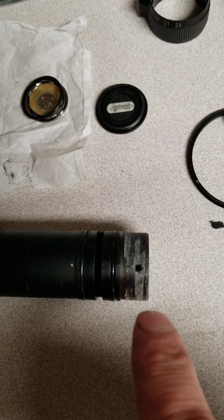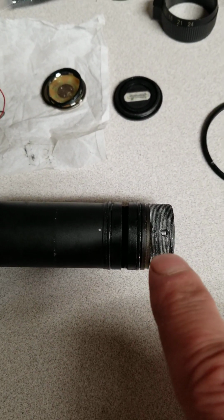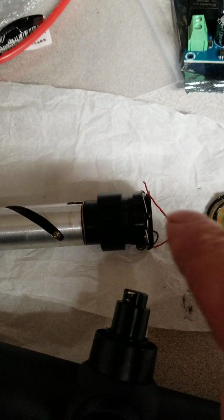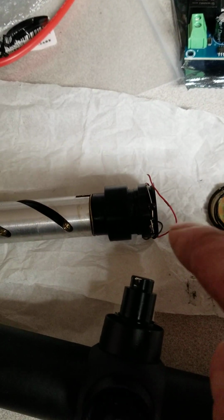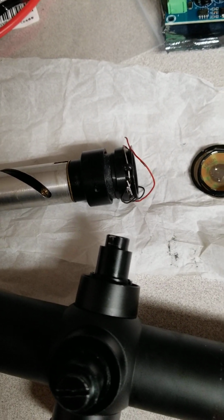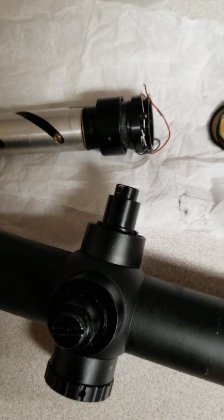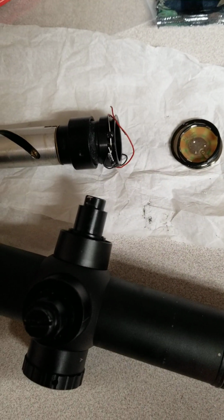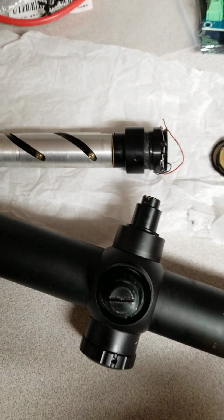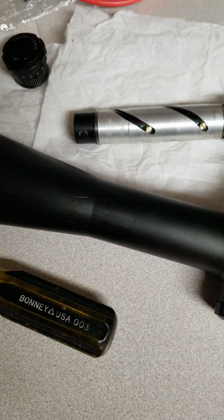And then I noticed maybe that is Loctite, that white stuff. I'm not sure. I've only seen that there. And again, I tested the wires, I tested the illumination with the 2032 battery, and I didn't see any effects. So it looks like one of the settings is without a resistor. Hopefully I didn't fry anything there, but maybe there are some other issues. I didn't desolder and resolder to check and see.